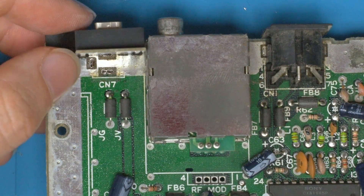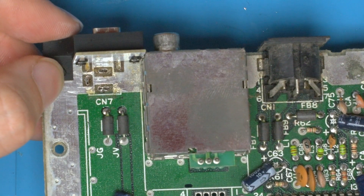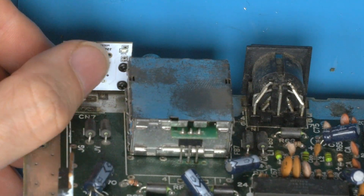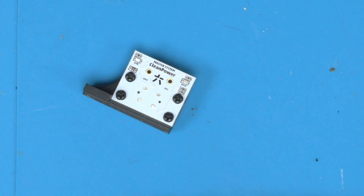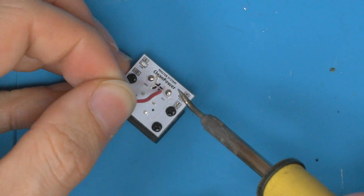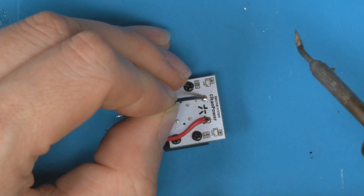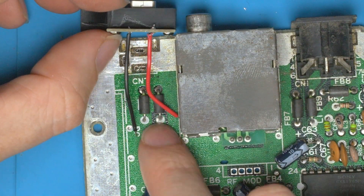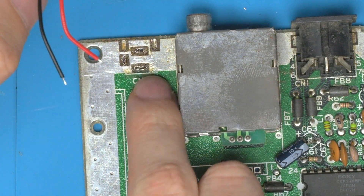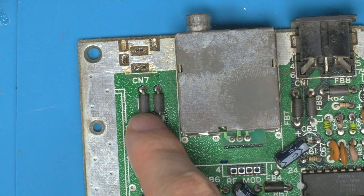With the DC jack off, the new clean power board will sit over this hole and lock in through the screw thread when it's in the case. The only thing left to do is solder in the ground and VCC wires to the ground and VCC pads. Take the red and black wires from the kit — poke the red wire through for VCC and the black wire through for ground. You can go above the diodes, but there's really no need since this is always the correct polarity and you'd just get voltage drop going through them.